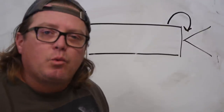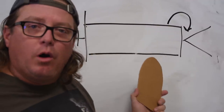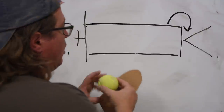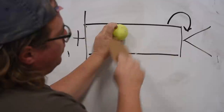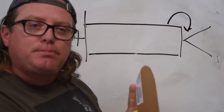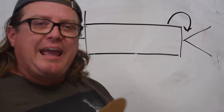But you need to understand, this explanation is as if everything was in a 2D world. And we know wood is not 2D, it's 3D. So a better explanation would be a ball. If you are engaging the wood, obviously the wood is coming off at you this way, but when you get around here, we have to change our tool angle, change our tool adjustment, change our tool approach in order to get that 45 degree interaction.